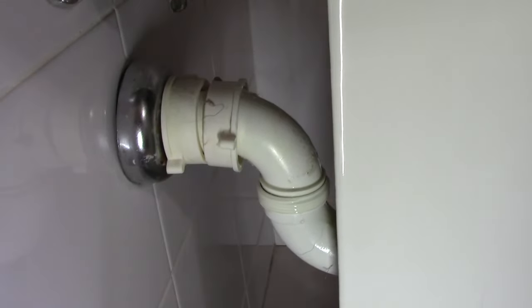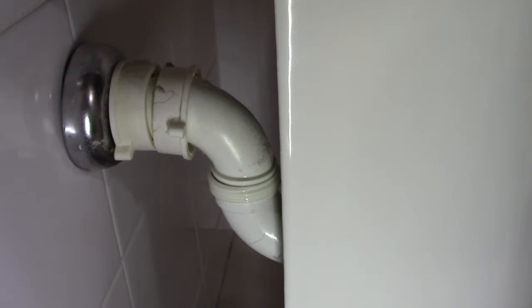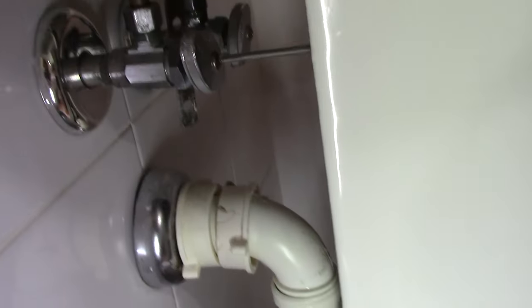We're just going to dry up the area we're working so we don't have any water damaging anything. Next, up underneath the bottom — you can see that bolt right there — it looks like a 9/16" nut. We're going to remove that 9/16" nut and one more on the other side, and then this pedestal will be ready to come off the base.